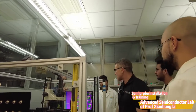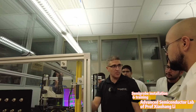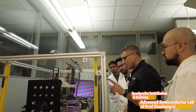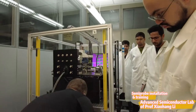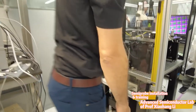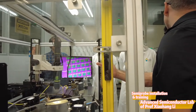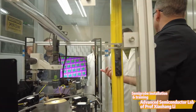If you are measuring the system at 3,000 volts and someone accidentally comes in, what happens is this is all connected — once it's green, the measurement is on. This whole system is connected to this device, which connects to the 4200 or the B1500. As soon as you put your head or hand here, the voltage drops to 40 volts on the tool. So when you touch it, you just get a little zap — you don't die. It's a safety.